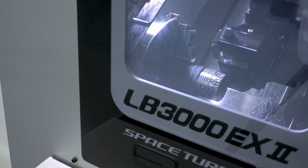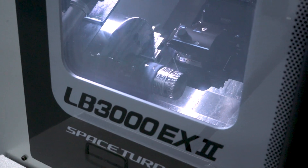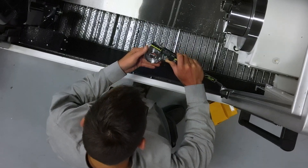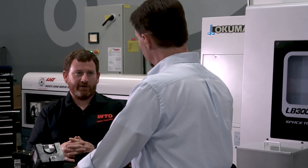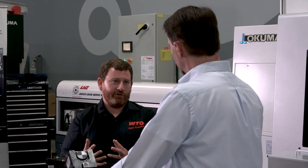Synchronizing the part turning with the teeth of the cutter — exactly. And that allows you to have a very precise, very high level of detail and accuracy. We can do up to ISO 1328 Class 8 or AGMA Class 8. And we can typically do a class or two better than that, depending on the setup, the application, the tooling — everything has to work well together.